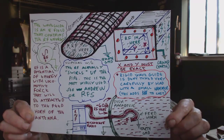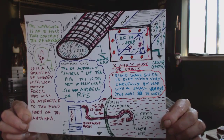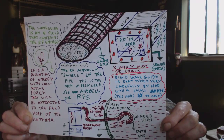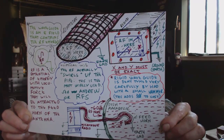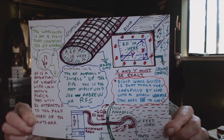To the left of that you see a piece of elliptical waveguide. Elliptical waveguide is made to specific tolerances and tested at the factory. If you get ultra premium or super premium waveguide, it's going to be 29 dB or better return loss.